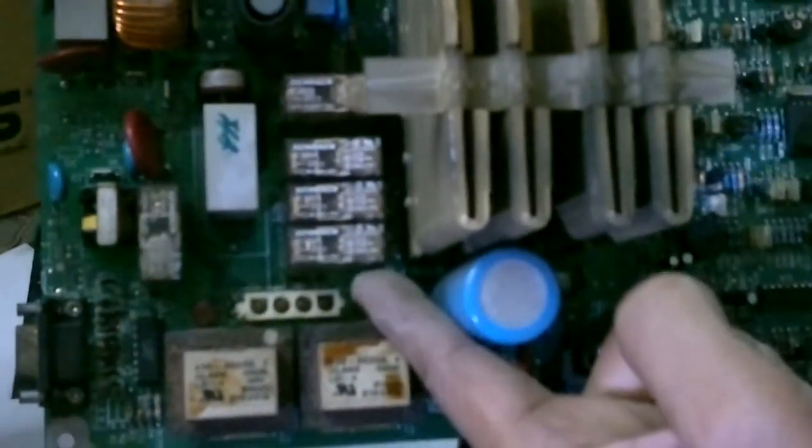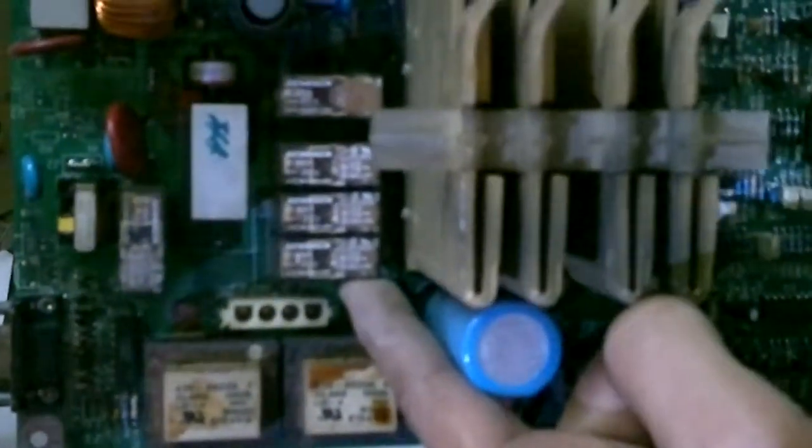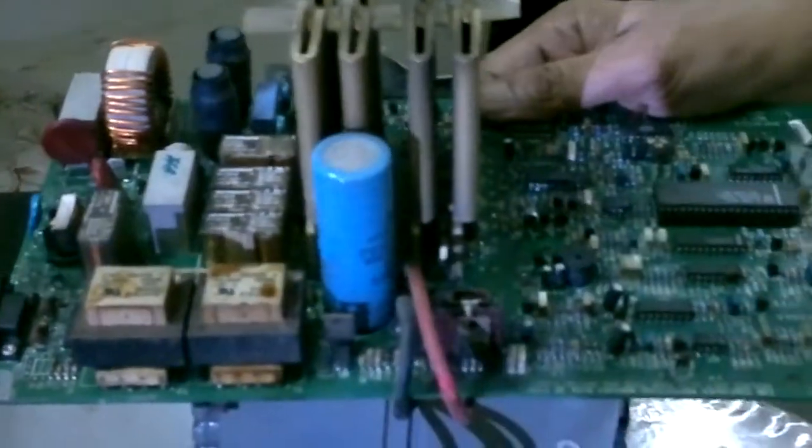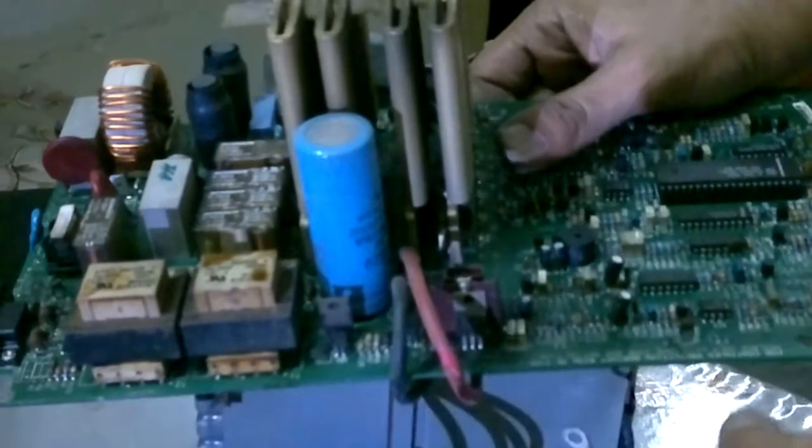You've got to match it up with the circuit. It's written here — you can zoom in to see that it's written: Neutral, Tap, then Hot, and then Tap again. So this matches your transformer. If you want to use this, just don't use these taps — just use the hot and neutral.